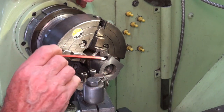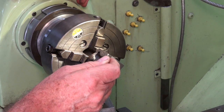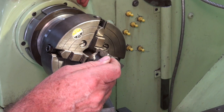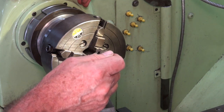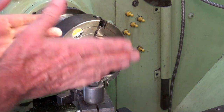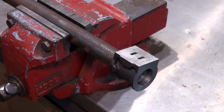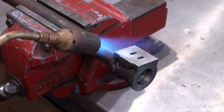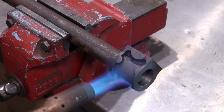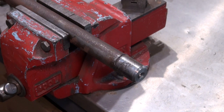That's cleaned up nicely. The reason I'm using high speed steel rather than carbide is that carbide tools require a lot more cutting pressure to get good results. If you're just taking light cuts, they tend to exert too much pressure on the job. I think high speed steel is probably the best choice here. I'm going to get the micrometer on that, work out the difference, and then gradually bring it back to the correct size.